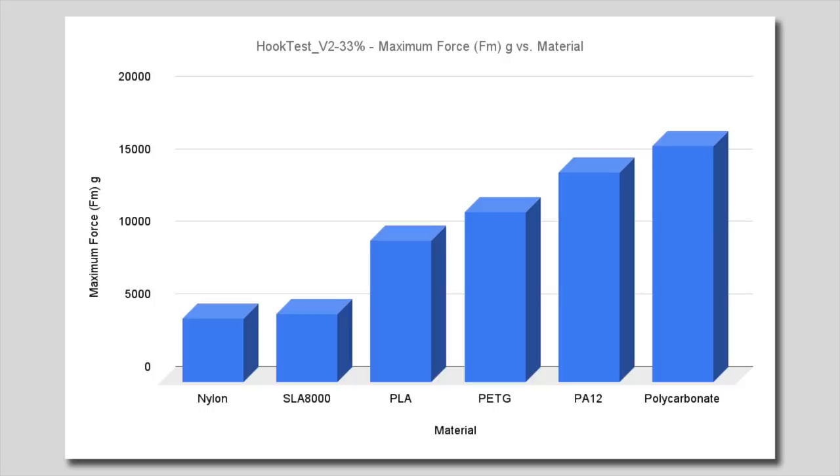We'll get into print quality next time. I'd say polycarbonate for purely functional prints like this, PA12 if they really need to look nice also. You are giving up very little performance for the quality difference. But as I said, don't get the idea that the Creator 3 Pro is representative of what it's normally like printing with engineering filaments. I found it much, much easier to do on that machine.